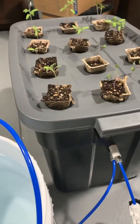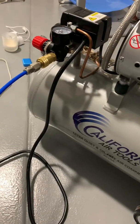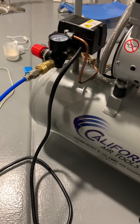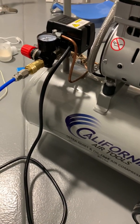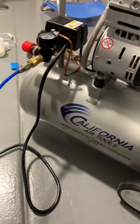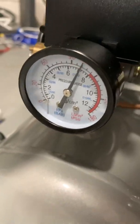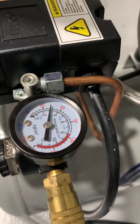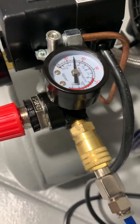The next important thing is the air compressor. This is just a basic air compressor I bought online — it's like $200–$300, something like that. We'll see how long it lasts, but it's pretty quiet, which is nice. The air compressor has a pressure in the tank that goes up to about 100 PSI. There's a regulator valve, and for this specific nozzle to work you need to be pressurizing it at about 45 PSI. You turn this red knob until you get the gauge to around 45.